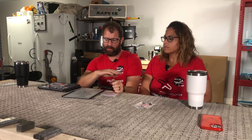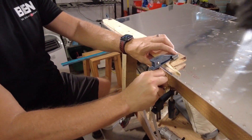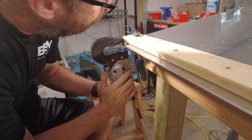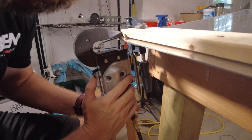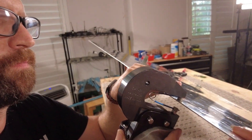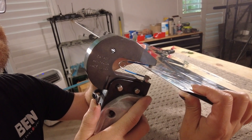Some of our viewers and friends have advice on how you can set the depth, because hitting that rivet forward and backward just right is important. Someone showed a video of putting a piece of angle aluminum across and mounting it — we tried that and it wasn't working for us. I found that eyeballing it worked really well. I felt comfortable lifting up the rudder, really seeing it, and setting it well. Whatever works for you, do it over and over — there are a lot of them.